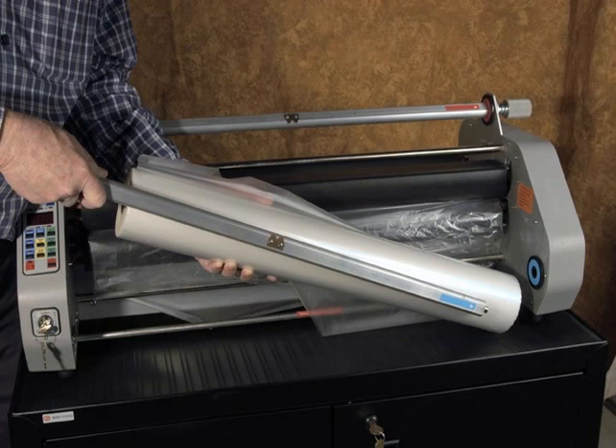Laminating film is made up of two layers: a glossy layer which gives the lamination its strength, clarity, and rigidity, and a dull or matte side which is heat activated and serves as the glue to bond the film to the product being laminated. Once heated, small amounts of the glue can stick to the heat shoes and the rollers must be periodically cleaned of the laminator.